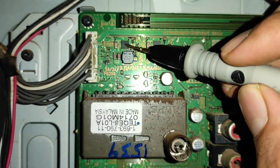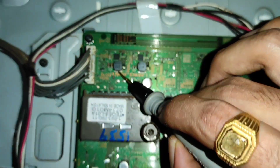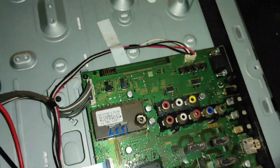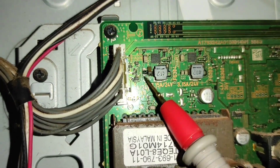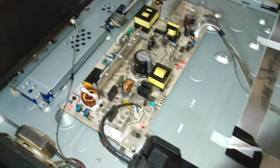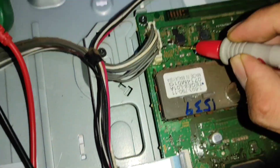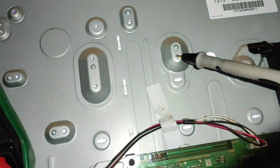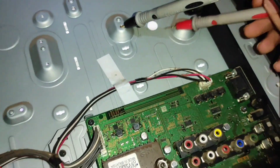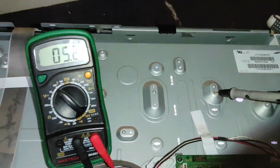In my case, I checked every capacitor and everything showed fine, but I had some doubt about two capacitors. I removed those two capacitors. After removing them, I am now getting 5.2V. Now the TV is also turned on and it is not going to standby mode anymore. As you can see, due to the shortage of those capacitors, I was getting this type of error.